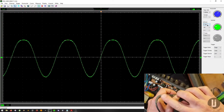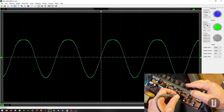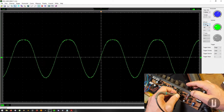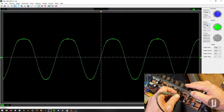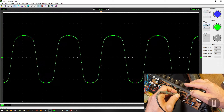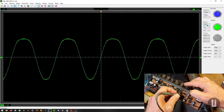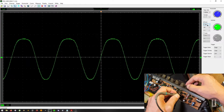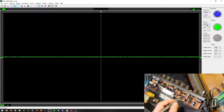Pay a little bit more attention — see how it's soft on the top. That is soft clipping. And not only that, the bottom still resembles a sine wave. So not only do we have amplification and soft clipping using logic gates, we have asymmetrical distortion. That is huge. See how it keeps getting more and more pronounced. At full gain it's still a beautiful, very round type of distortion — asymmetrical and very soft. That is what you expect to see on a tube amp, and we're achieving that in solid state.